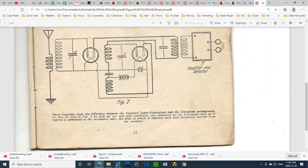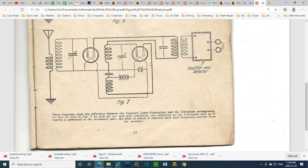So this guy's humming along, as we've seen. So spirited, he's actually putting out 2 frequencies, probably many more, multiples of the primary frequency. This guy is on and off, on and off, on and off. That certainly introduces a non-linearity in which you can generate the harmonics you're looking for with this circuit. You're trying to get a harmonic, or not a harmonic, you're trying to get a difference frequency out of the local oscillator and the incoming tuned signal.